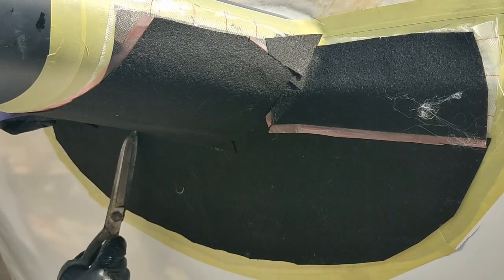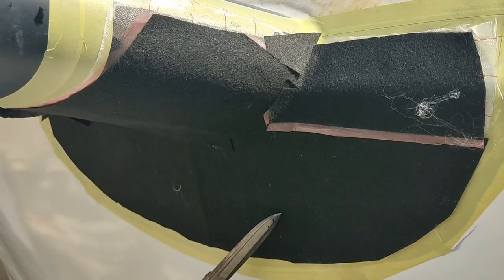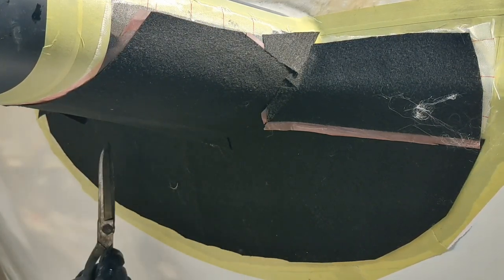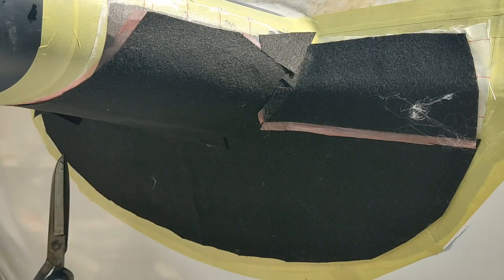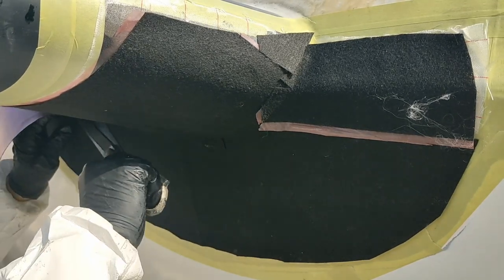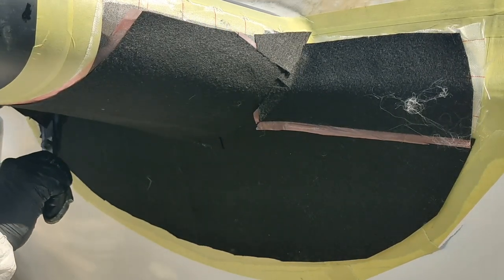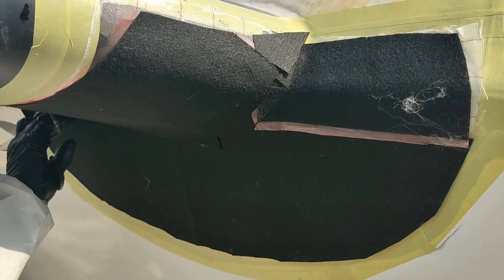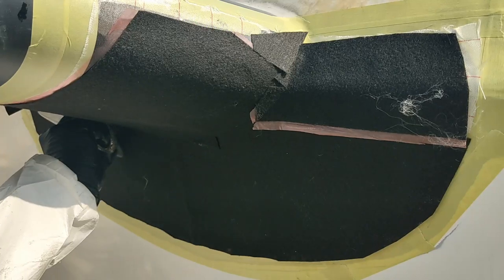If we ended up with a resin seal across here, my frog's mouth is here, it'll seal, and there's a tiniest air leak here. The vacuum pump can't get the air from this side to the vacuum pump because it'll be sealed off by resin. So the breather felt allows passage of air, if there's any air leaks anywhere, to get from wherever it is in the bag through and flowing into the vacuum pump. This is why we don't actually like the breather felt to completely fill with resin and bleed out so much that it fills the whole of the breather felt up.